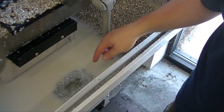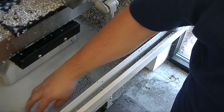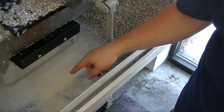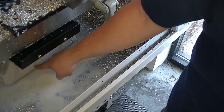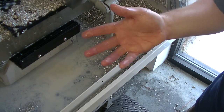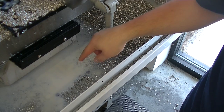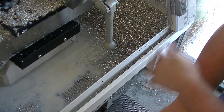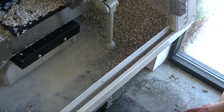Getting into a different view here — one of the big issues is I've got this thing just cranked and running. I'm trying to keep this draining, because this would get filled up, and then I would actually get the coolant to such a height in here that it would start to leak through the bolt holes. I got that cleared out, and having that sieve in place means that if chips get through here, it doesn't matter, because they're going to get captured anyway. The system can just drain everything off, and you notice it doesn't ever build up.